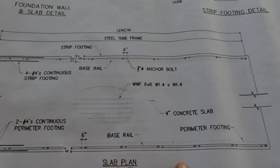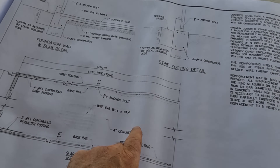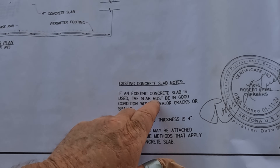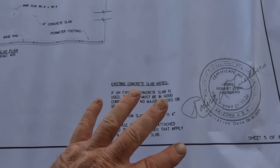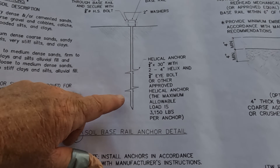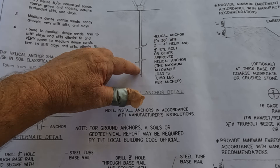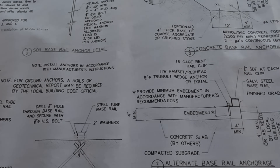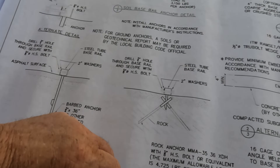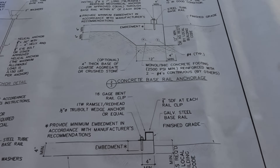Here's a nice look at the inside — wire mesh, which I'm going to use this technique. Two rebars all the way around continuous, four-inch concrete slab. It also shows here that if an existing concrete slab is used, the slab must be in good condition with no major cracks or spalls, so you can technically attach this building to an existing slab. There's another hold-down technique: rather than no footings at all, you can use helical anchors to drill down and anchor — that holds the whole building down to the ground with no concrete involved. There are a lot of different options on this plan — it about covers every conceivable possible way to build these, all in one plan.